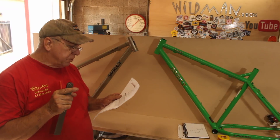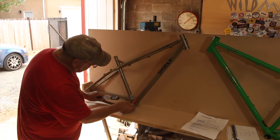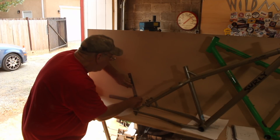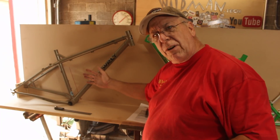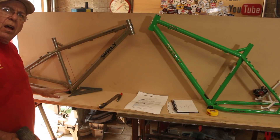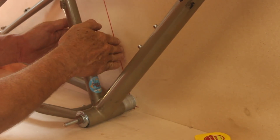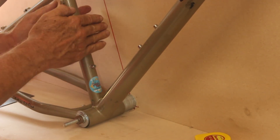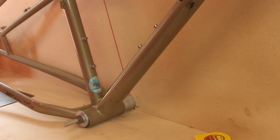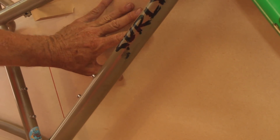We've got the frame geometry specs from Surly and we know that the seat tube angle on this frame is 73 degrees. So we'll back the frame up to this end block here and establish a line of 73 degrees on this backboard, and that will allow us to align the frame properly. To make sure the frame is in a straight line, we're going to measure off the back wall and bolt the frame to the wall, using washers as alignment devices to square the frame to the fixture. We marked our line on the backboard, aligned the seat tube to that line, then bolted it with a stack of washers to space it off the back, adding a small spacer to keep it perfectly parallel to the backer board.